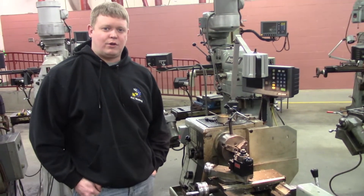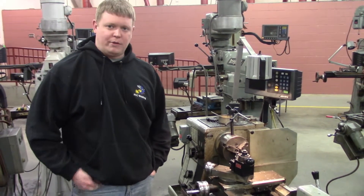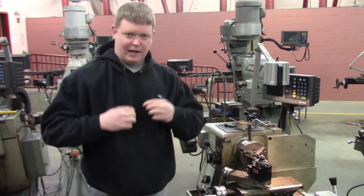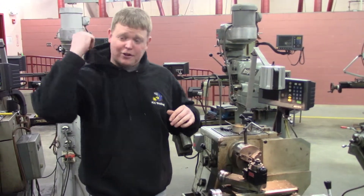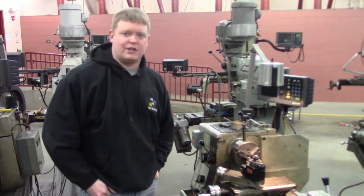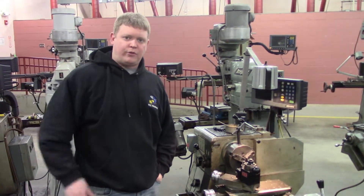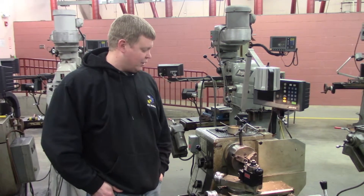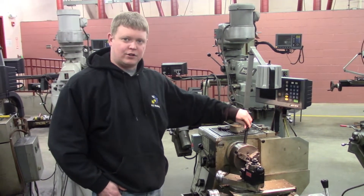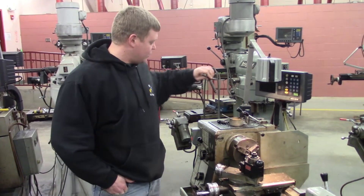There are many safety issues that go with working with the lathe. One of the main ones — you can see I'm wearing a hoodie — loose clothing is probably the biggest one. You've got the hood, you've got all this stuff that can catch. If you have long hair, jewelry, things like that, you want to remove all that before you start. Another safety issue is leaving the chuck key in the chuck, because when you turn it on it's going to go into orbit. So you don't ever want to do that.